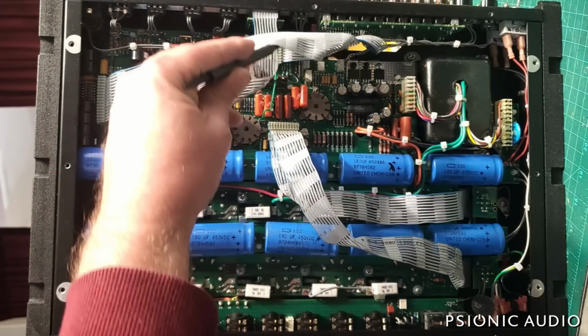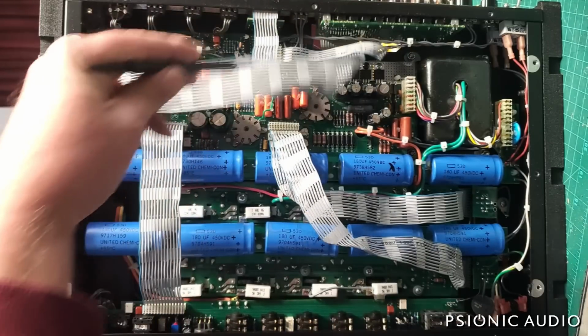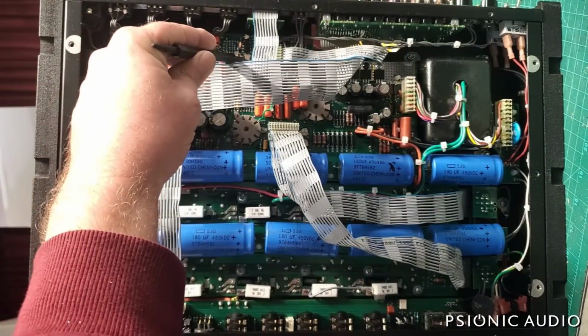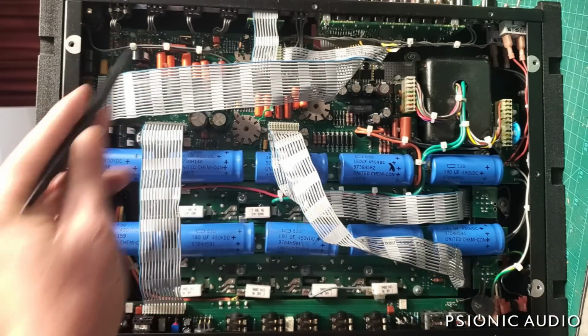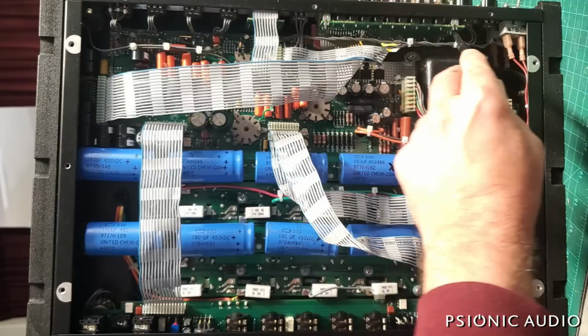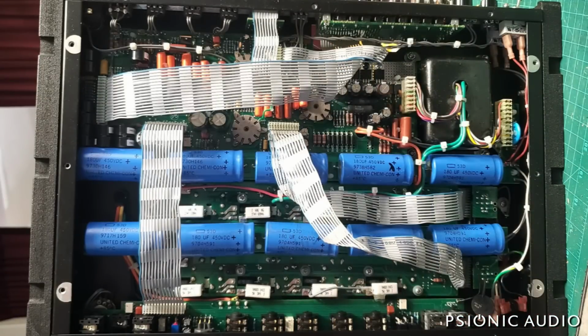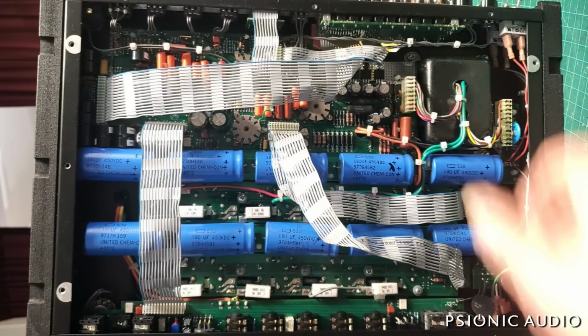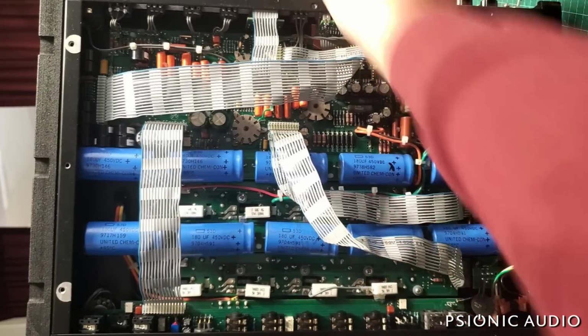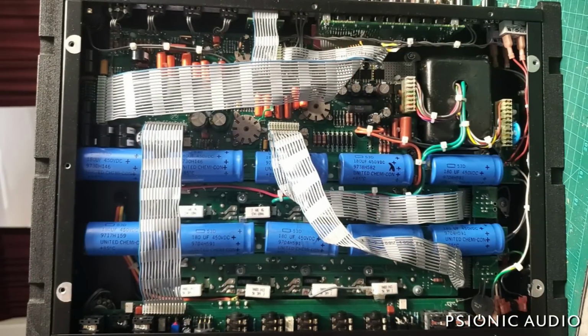So the signal goes in to V1, which I think is this one, and a whole bunch of op-amp stuff. And then it has the EQ stuff, and from there it goes to the effects loop. From the effects loop it goes to the master volume. The master volume is not affecting the noise we have. After the master volume it goes to V2, which is the first stage of the splitter driver.